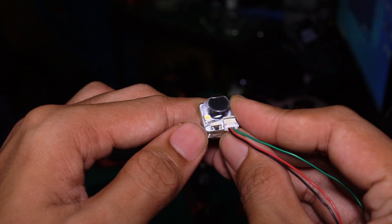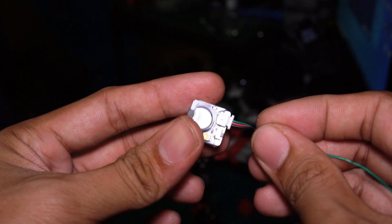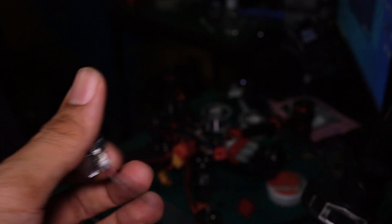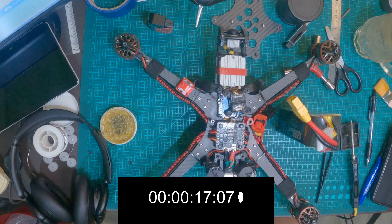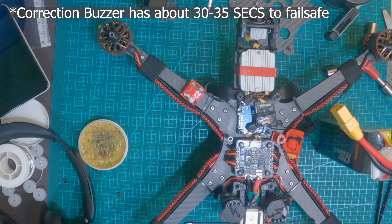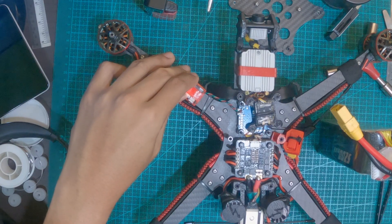Next, I opted for a buzzer with a built-in battery — this is the GHE-42B. It follows one rule: when the lipo is disconnected from the circuit, it will count to 10 and then begin beeping, powered by its inbuilt battery. This is the fail-safe to find your quad if it gets disconnected from the lipo and lost in the middle of a bush.